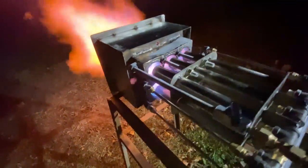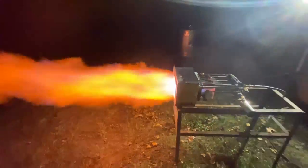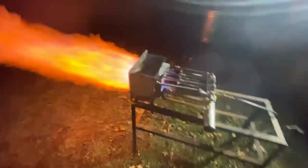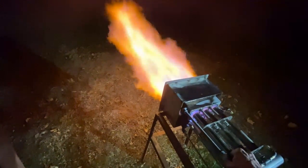Look at the frost developing on our vaporizer box, guys — that is a great sign. We're not overdoing it too much and we're not really underdoing it either. That's kind of what I was worried about. I just took a swing at how big I thought that vaporizer box would need to be, and that's based off some prior testing that I've done.